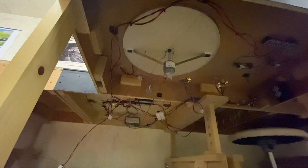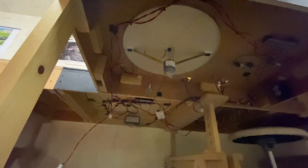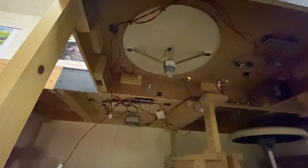I could use a choc block but unfortunately the wire on the decoders is really, really thin. Red and black to track — I believe that's the adage with DCC decoders. So what we'll do is quickly tin these wires.